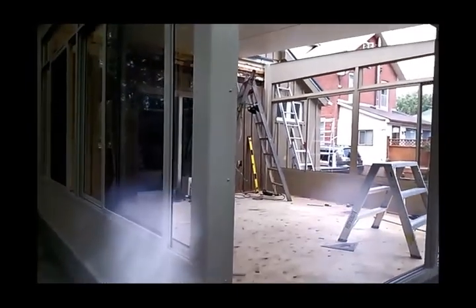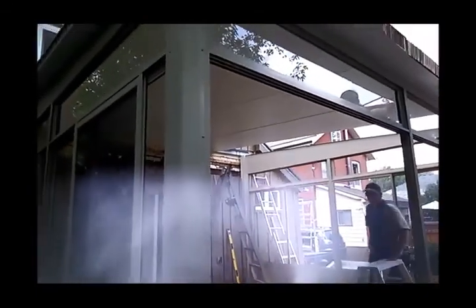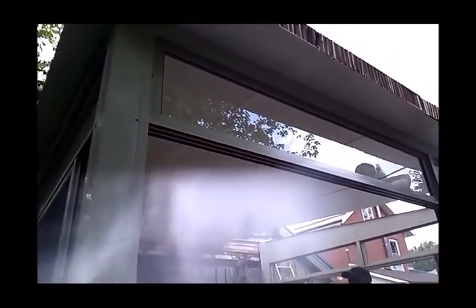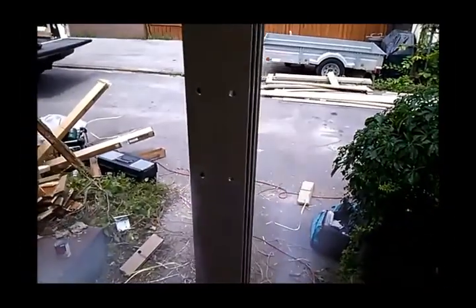But you have to engineer for wind load, not just snow load. In that big swivel header up there also, there will be more screws placed later because those roof panels are being bolted into that swivel header. So it has to be connected properly to the wall system. There's the bit I need in my belt already.